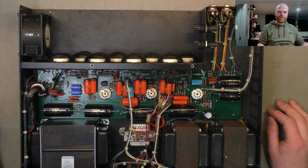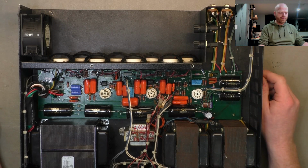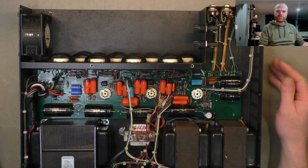We'll probably never find out. But it stinks. It's corrosive. It destroys the wiring. It works its way up the jacket of the wiring, so you can't snip any off and resolder it. Whatever it is, I've never seen it in any other amp other than the good old Mesa Boogie.